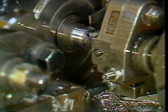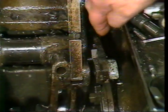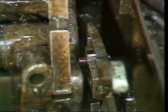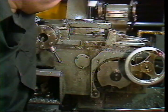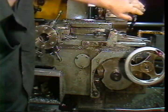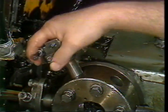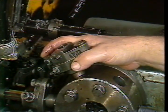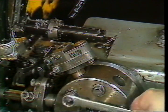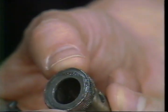This training tape will give you the information needed to mount and adjust the swing type recessing tool holder. The setup begins by disengaging the stock feed mechanism by lifting the dog on the trip lever. Run the machine under power until the turret roller is at the start of the recessed lobe on the lead cam. Stop the machine, insert the tool holder into the turret, visually align it, and tighten the clamp bolt securely. This is the eccentric bushing — when the spindle is rotating in the forward direction, the hole in the bushing should be towards the top of the fixture.